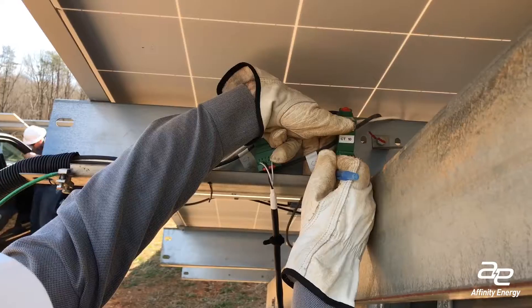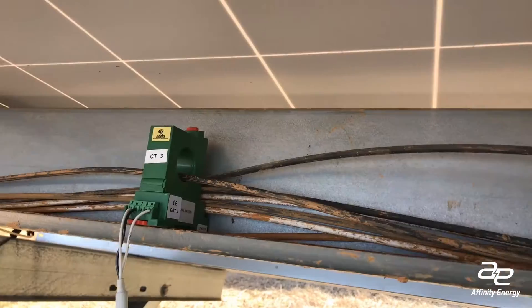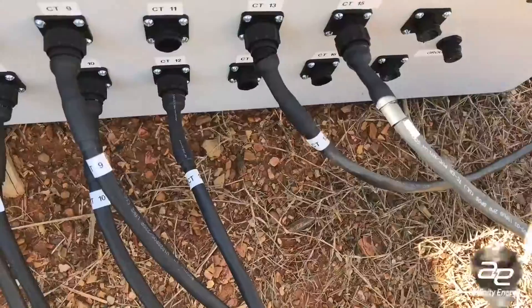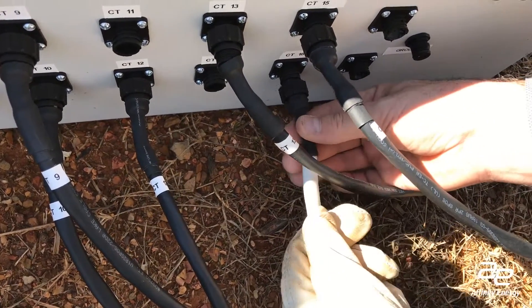In order to keep things organized, label each wire with the same number as the CT clamped to it. After you've installed all your CTs, plug each CT cable into the input it's paired with on the enclosure. If the CTs aren't plugged into the correct inputs every time you move them, the data will be corrupted.